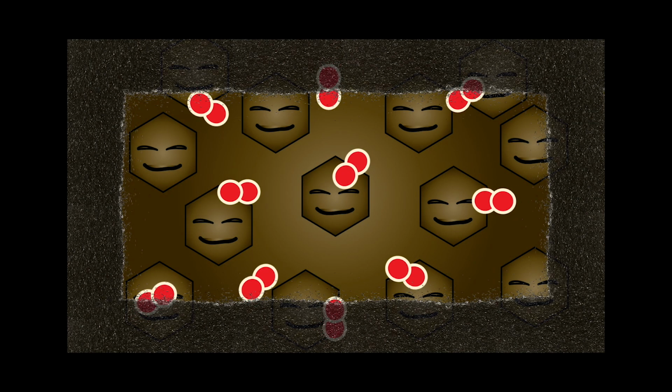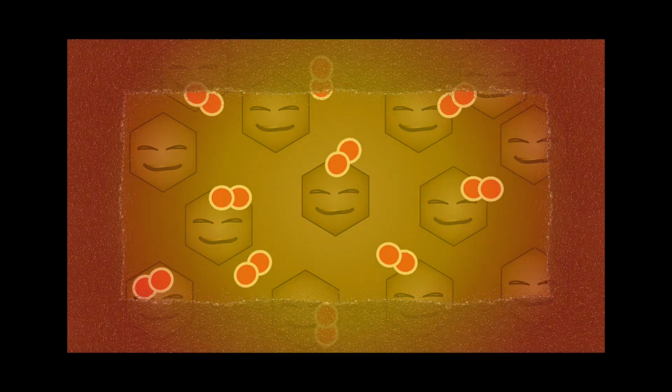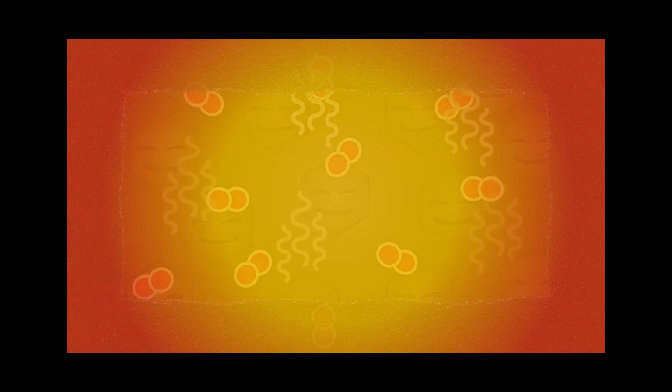As the kiln heats up, the carbon and oxygen particles begin to react. The carbon begins to consume the oxygen inside the vessel and prevents any more oxygen from coming into contact with it. Set your kiln to take an hour or more to actually reach sintering temperature. When the metal clay finally reaches those temperatures, the particles become excited, move together, and bond.